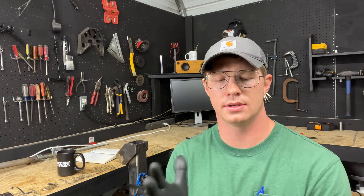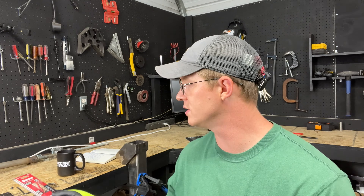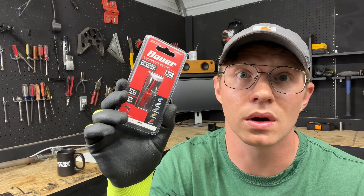I was watching some YouTube videos and found a YouTuber who had an engine block with a broken tap and he used a very small diamond-coated hole saw to remove it. So I went to Harbor Freight and got a Bauer hole saw — 3/16th inch, just undersized from our tap — so hopefully we don't mess the hole up too much and can still use it. I need some water to keep it cool. Based on the video I watched, this is going to be a long process. I'll put a link to that video in the description.